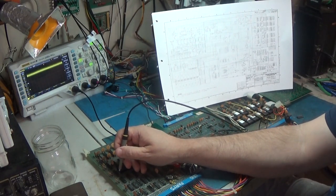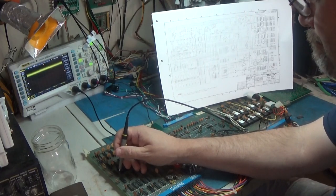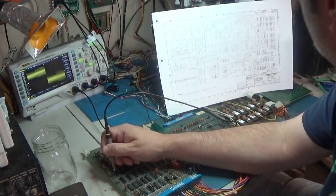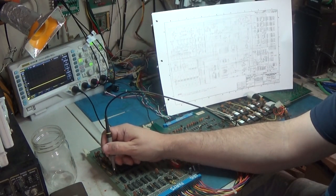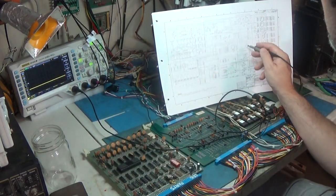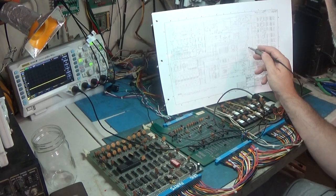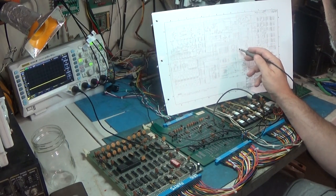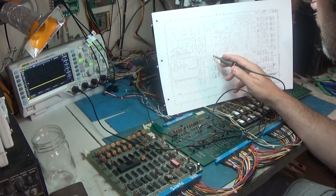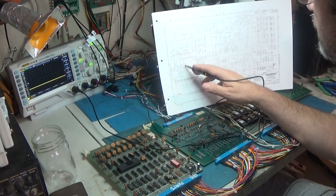And it's high, which does make sense, because we have a clock, and J being high and K being low, it's just going to be high until it gets a clear, and then it'll clear Q to low. That's how this is working. It's working on the clear signal. So when it clears, the clock signal comes from RAM, it looks like. No, it doesn't. It's hard to tell. The clear signal. It's clocking the data into the RAM.